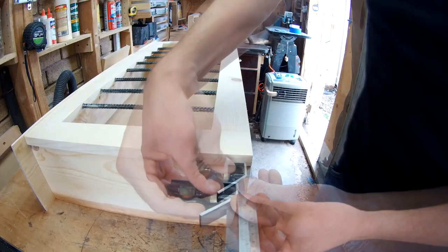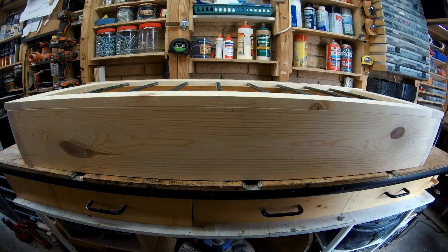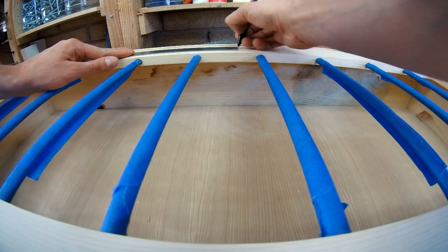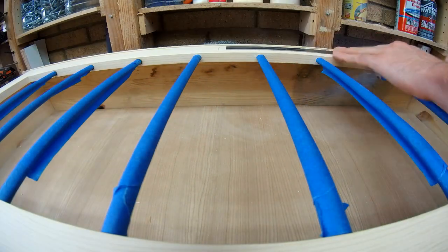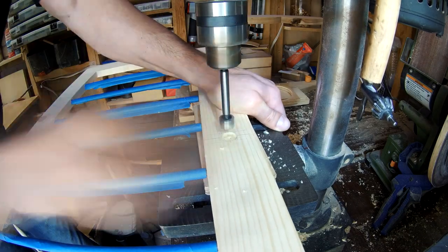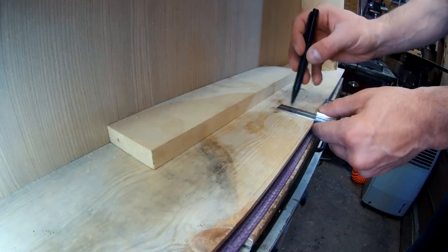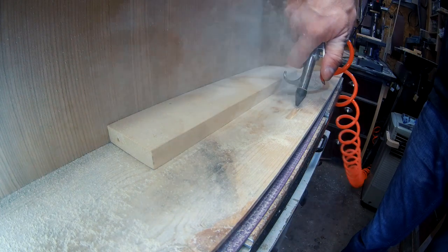The next step is to take out my square and perfectly center the frame on the box, then measure out my hinge locations. Once the hinge locations are measured out I'll drill the first hole and put the screw in to hold the hinge in place for the rest of the holes to be drilled. Then I'll measure the position for my cam lock. If you want to know how to mount a cam lock perfectly in wood without having to glue it in place, I made a full video explanation of my method and I'll leave that link in the description below. Now I'll mark out the slot that'll receive the cam when the lock is engaged and I'll route that out with the palm router.